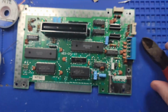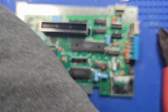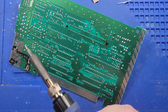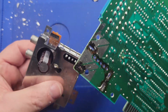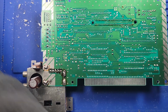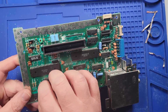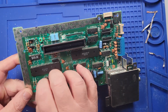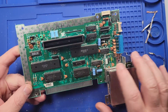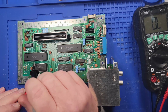Well, I suppose we better get all of this low melt solder off of these pads. Well, I think that's good enough to hold. So I guess we should try to maybe check this connector. Make sure we don't have any open runs. I can't see where some of these go though. So I'm assuming this is ground. It is. This goes up here somewhere.